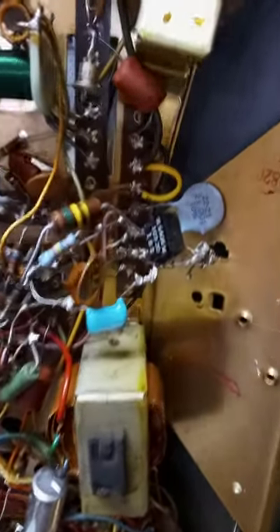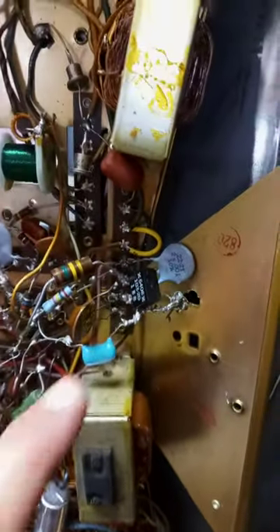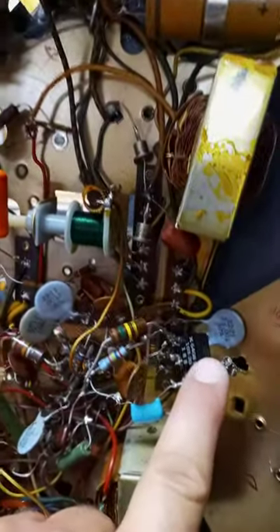I didn't make a mistake. I do remember when I first got this Zenith television — this is just a quick note to part two. I did replace this selenium rectifier here because the problem when I first got the set, the picture was shaking, it was just twisting and shaking really bad, and this is usually a culprit.